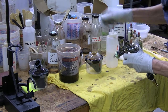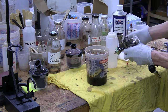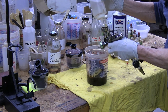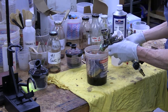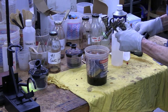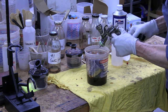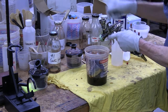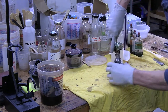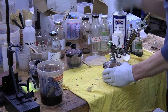To clean out the inside of the gun, I'll take some lacquer thinner and fill up the PPS adapter to about the top. Then I can pull the trigger and let the lacquer thinner flow through, which will purge all the dark color from the barrel of the gun so I'm clean when I start with the light color. Then it's just a simple matter of popping the center light color onto the gun and we're all ready to go.